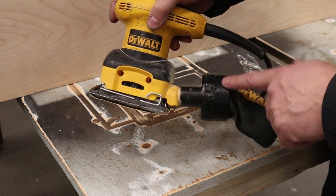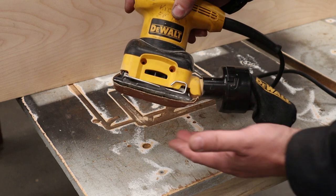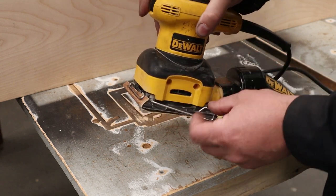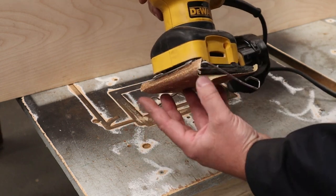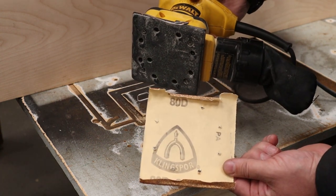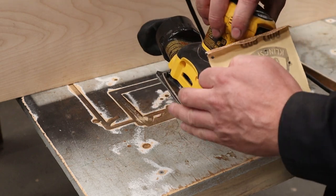It will not collect 100% of the dust, but it does a little better than not having it. And then there's two major types of how the sandpaper connects. You got this type here where you undo these little levers on the sides, and that allows you to undo the sheet and cut yourself another quarter sheet and put it back on. Make sure that these hold that paper in place